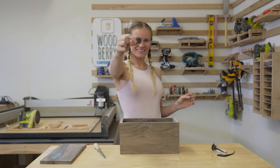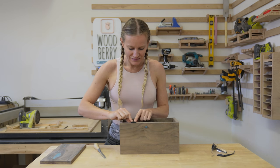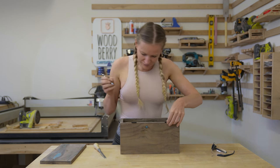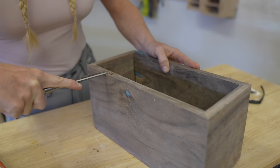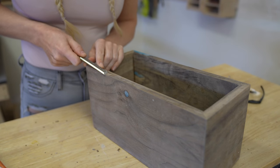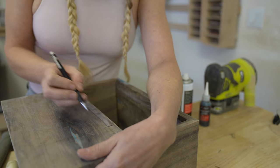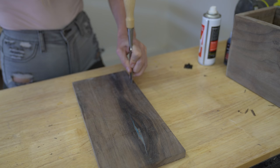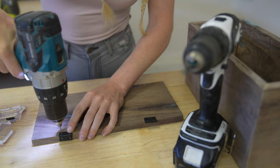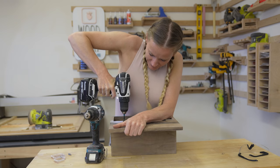To attach the top, I'm using small black hinges. To make the hinges fit properly, you will have to cut out a little groove — the best way to do so is by using a chisel. Use a pencil to draw the shape of the hinge onto the box, then use a chisel to clean out the shape. Press the lid against the box to copy the location of the hinges onto it, then use the chisel to make the groove. To attach the hinges, make sure you pre-drill the holes, then use a screwdriver to tighten the screws.